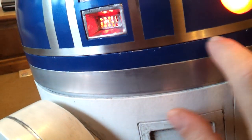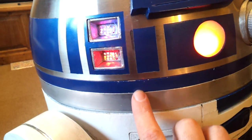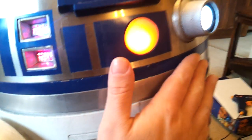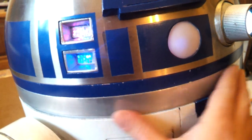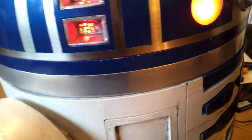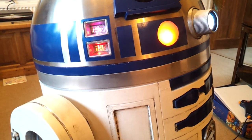The top bowl — the head itself — I got from Ikea. It's called a Blanda Bank, I think. There's a lazy Susan type bearing under here, with a strip of aluminium glued around it, and then a piece of MDF on top. The head separates at this joint here, and the whole head can rotate around that axis. You can hear it crunching a little bit — there's a stepper motor inside because it's computer controlled and needs to know its position at any time.